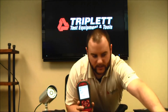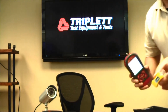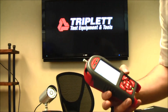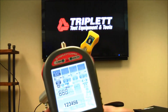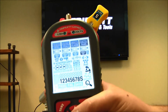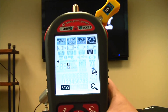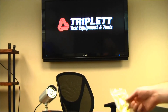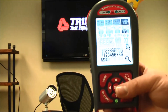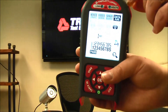With the 30SR, the big additional feature is smart remotes — little yellow remotes great for working on RJ45 cables. They act like multiple ID remotes but are also numbered, so you can map out eight cables at once. I'll plug in this number five remote and go to the RJ45 data cable test. It passes, and pressing the cable ID button tells me it's remote five. These smart remotes also run a full cable test, something that doesn't usually come with standard ID remotes — very helpful for multiple installations at once.